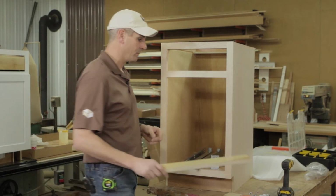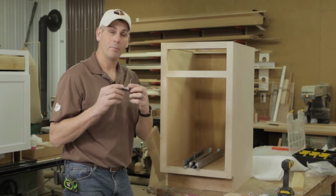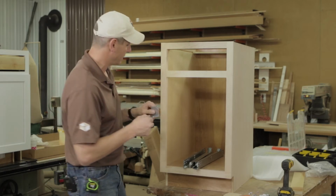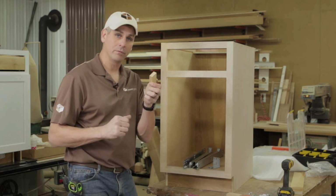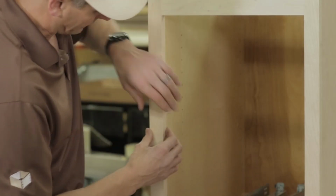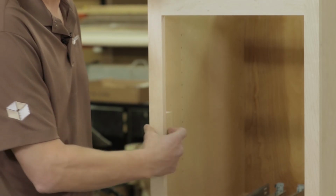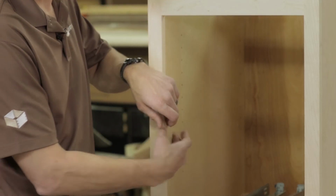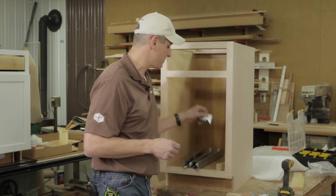What we're doing instead, I'll walk you through that now. What we're doing instead is making use of the metal angle brackets, just like our Bloom Tandem Drawer Glide video shows. We're using these at the back of the cabinet, and then we're inserting 2 thinner blocks of wood of our own. We get these ourselves, just scrap from our shop. And these mount behind, and now they're dead even or even a little bit inside of the front frame. And now that drawer box has room to move. So we just pre-drill a couple of holes in these blocks of wood, use a couple of wood screws and mount these in. So I'm going to walk you through this process, starting with the installation of these metal brackets.